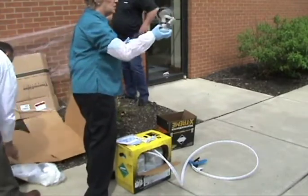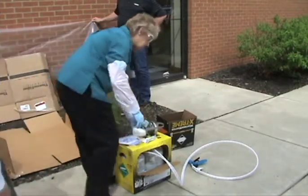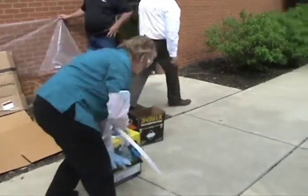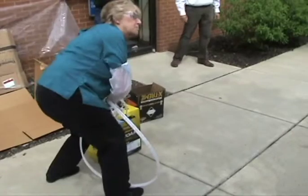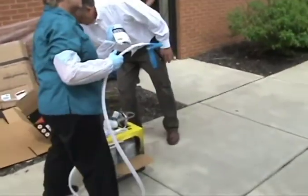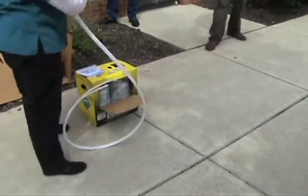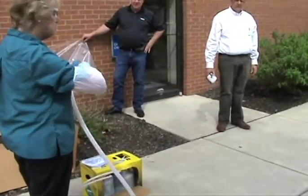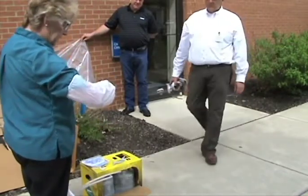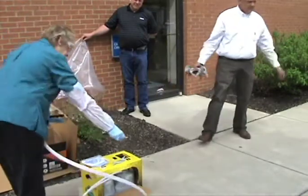And then we have the respirator, which I'm not going to put on right now or you won't be able to hear me talk. To set up the kit, this is coiled in the front, so you just pull this flap down, and your gun hose assembly and your nozzle pack are right there. Inside your nozzle pack, as Jeff explained, is a packet of petroleum jelly. The first thing you want to do is coat the face of this gun. It's not going to affect the product in any way, shape, or form.